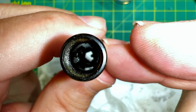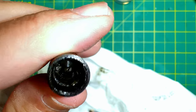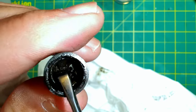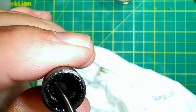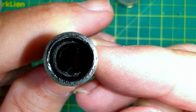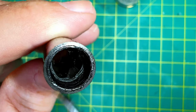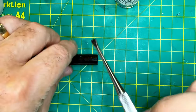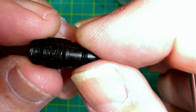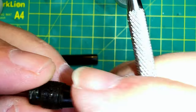And there's the inside of that barrel. See? Lots of desiccated sack and still a little bit of that rubbery sack left. So that's going to take some cleaning. So I've discovered why this pump was so difficult to get off. Whoever replaced this sack on the pump put the sack all the way back onto the threads. So they moved the sack not back to here where it's supposed to go.